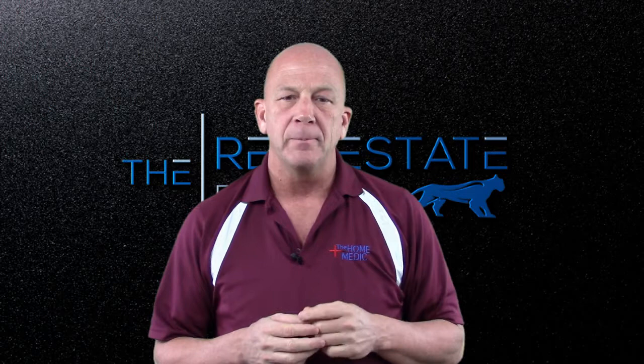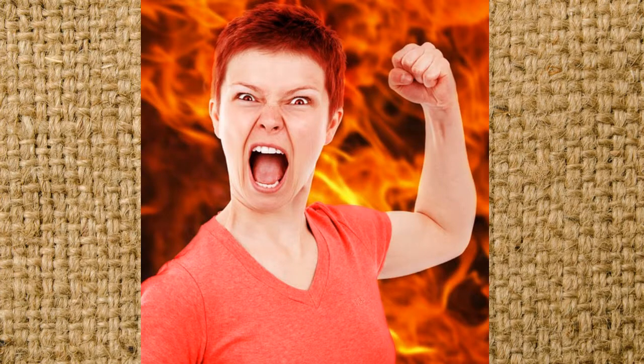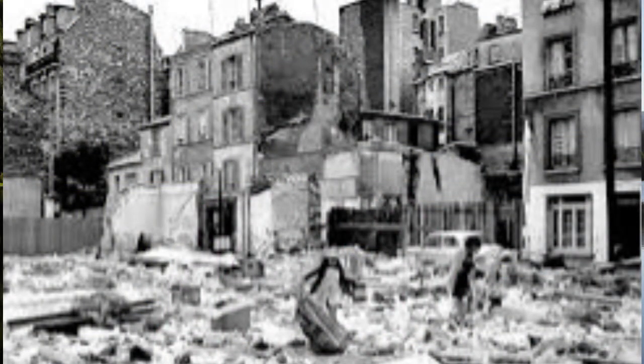Sampling can be a bit iffy if you're the home inspector. One of the rules for home inspectors is not to change the home in any way, especially without the permission and request of the homeowner. Obviously, you start changing things on a house that you don't own and you start getting phone calls from lawyers. EPA's recommendation assumes that the person doing the sampling is maybe a professional lead abatement contractor or somebody who definitely has approval from the homeowner to do these changes, because what EPA is recommending is a destructive test, as opposed to the non-destructive test that a home inspector is supposed to do.